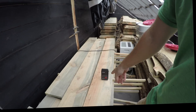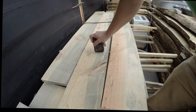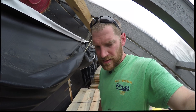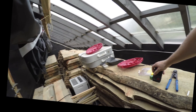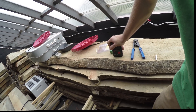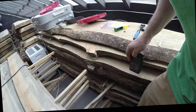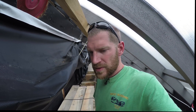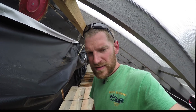These fresh boards are sitting at 19% right now — that one just went in the kiln yesterday. Another is at 17%, so these will be down to 6% in probably the next two days with good weather. As for my slabs, this one here is at 8%; they were metering at 6% the other day but with the rainstorm they're reading a little high at 7.4%. So for 2-inch material I'm able to get safely down to 6–7% in about two to three weeks.